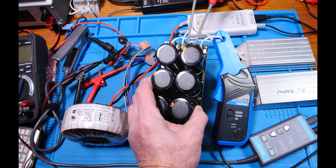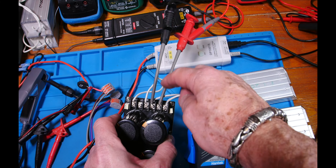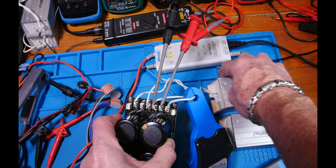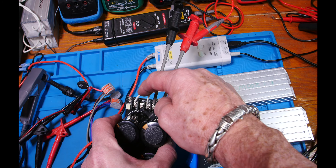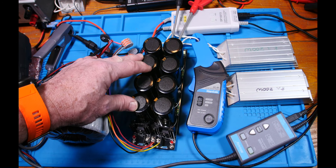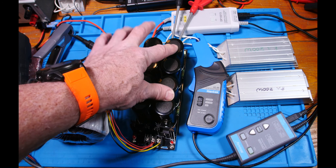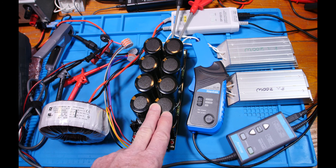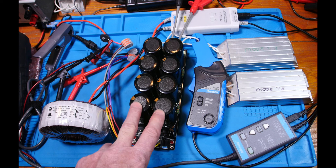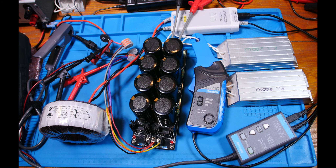Now you can see the big change. The same AC power is still coming into the input of the transformer, but now the output goes through the bridge rectifier to give us a plus/minus DC output. We have the big capacitors here, and then the resistors on the other side. The board has two center pins as ground, with each resistor having a lead tied there. This is a nice assembly — four 10,000-microfarad caps per side, rated 125V — I think it's around $35.